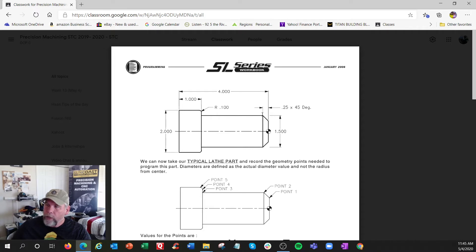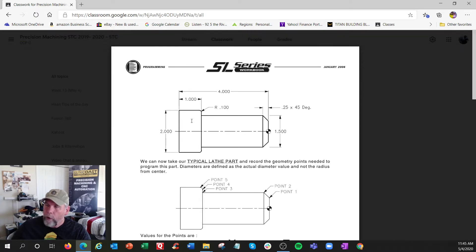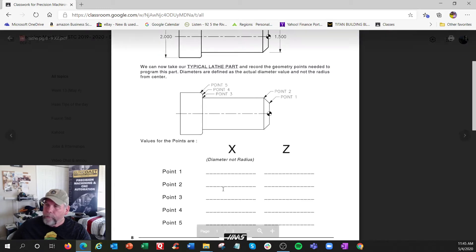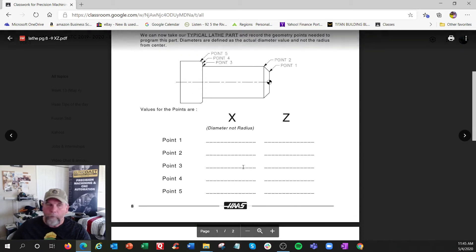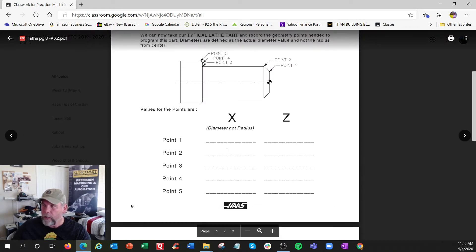In these cases, that's a chamfer — a straight line. You got to go up here a little bit, and there's actually a point right here: 0.4 is the beginning of the radius. It's going to roll around the corner and we need to get to the end here, so this is X 2.0 right up here. So you're filling in these points, you scan this sheet, and you send it to me.